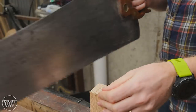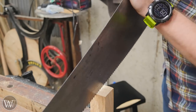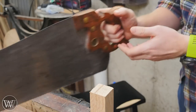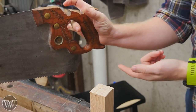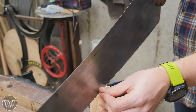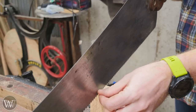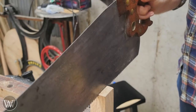The very same thing applies to the big hand saw. Put it on and rest it in, but with these big teeth, if you let any weight of the saw catch, it locks in place and you can't push forward. Instead, let this hand control the side-to-side motion. Put all the weight back on your wrist — balancing between that finger as the fulcrum and the wrist — and hold it up off the work. Let your thumb control side-to-side, hold all the weight up, let it scratch the top until a kerf gets running, and now the saw goes to town.